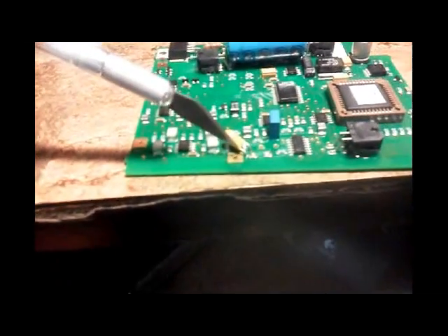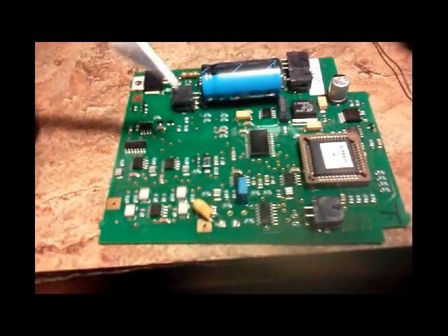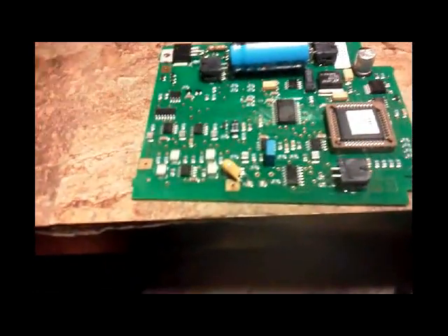Completed the repair — soldered it in place. I used the alternate holes; this is where the component was actually broken out. There's a wire there and board runs parallel to it. There were board through-holes that naturally worked for a through-hole mounted component, which I used. It's a 10 microfarad, 25 volt capacitor — a little better capacity, which doesn't change how it works. Whatever I reattached should make the entire metal detector work better. Garrett obviously had that in there for a reason, and it broke off. The original is surface mount technology, which I can't do.